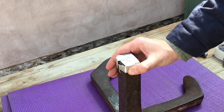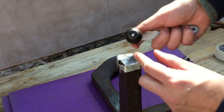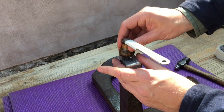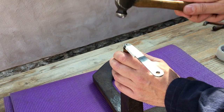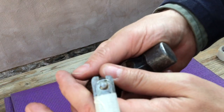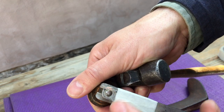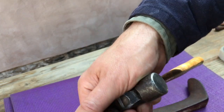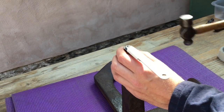We've got our piece of aluminium over the anvil, and the reason for this is it's just going to stop any heavy damage to this part of the pin. So here we go. What we're trying to do is reform this bit of the metal so it firstly fills the hole tightly — as we tap it, it expands and fills the hole — and also just rounding it off so it's not going to fall out. You don't need to hit it hard, just keep doing it gently.